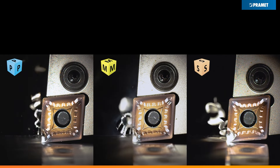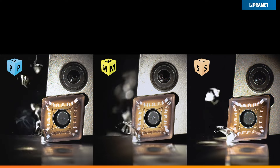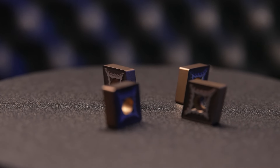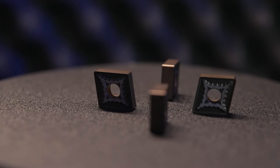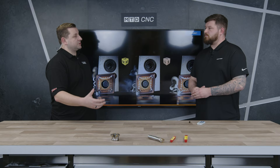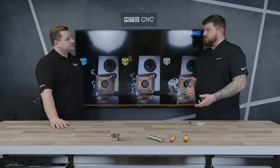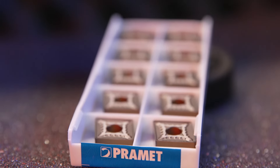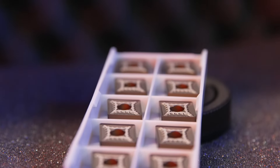What's this tip actually for? This tip is for a lot of your steel and stainless long production runs, and it can also go and do a bit of roughing on your super alloys as well. So Brad, do you have to sacrifice performance for those longer production runs? Absolutely not. You can run this at the speeds and feeds it's designed for because it is a production grade with that PVD coating.